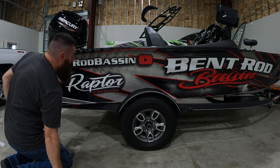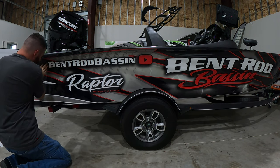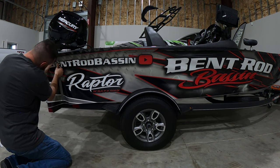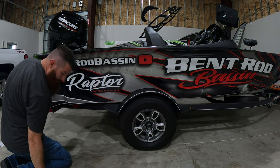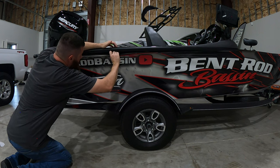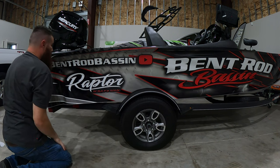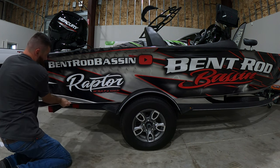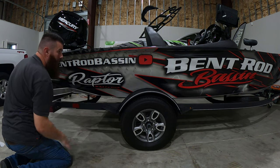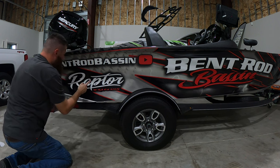Double-check this edge here — inch and three quarters — so we're just going to bump it down a little bit. This part might take a few minutes, just depends on how good you get it on the first couple tries. Sometimes you get it on the first pull but usually you have to kind of bounce back and forth a little bit. First try — two inches. Check in the middle — two inches. Down here towards the end — sitting at two inches. So that's all nice and level. Now we're just going to give it a little flatness to the wrap — we call it 'glass.' Right on that ridge is a nice place to kind of finger-pack it, and then we can come back through and work the bottom last.